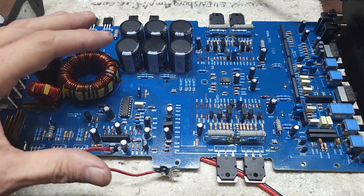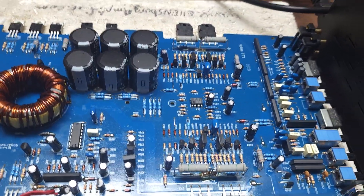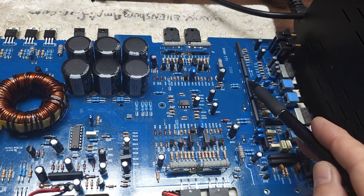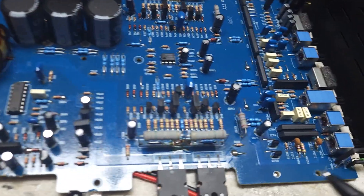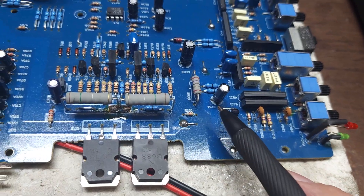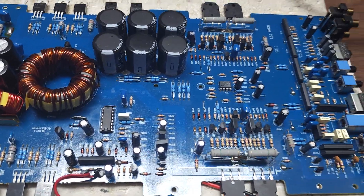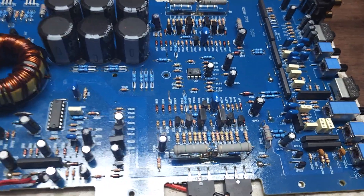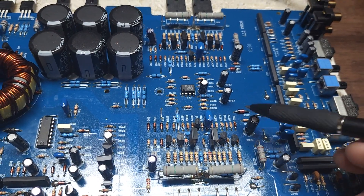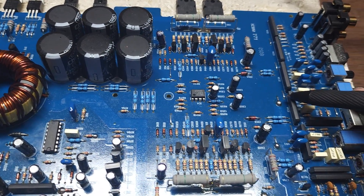This is a typical standard Class A/B amplifier — super easy. Here's your preamp, your auxiliary power — plus and minus for your preamp — and your mute circuit. As you repair more of these, you start to recognize these components because they've been laid out and designed the same way for longer than a lot of my subscribers have been alive. Class A/B has been a standard design for years and years.